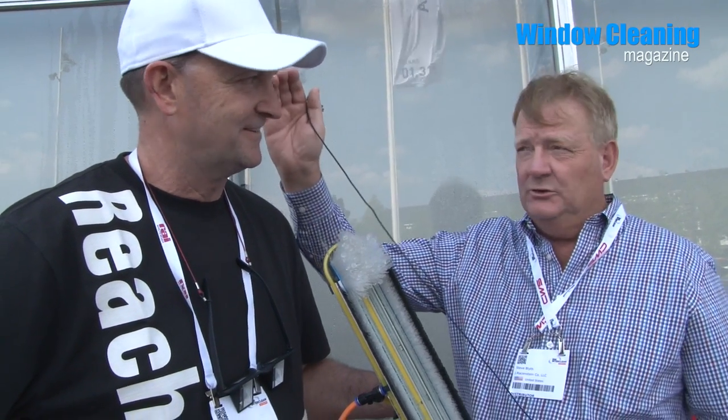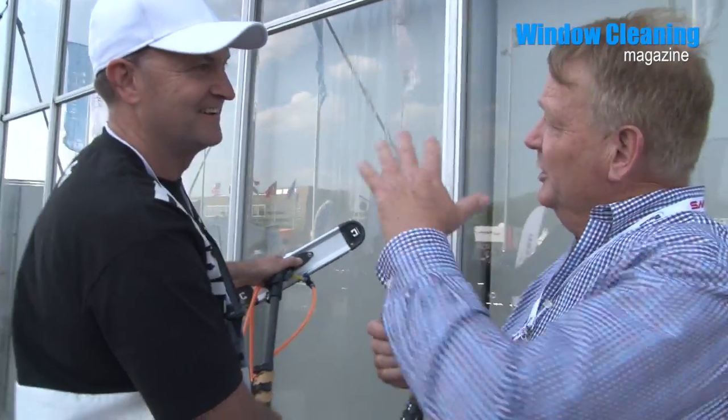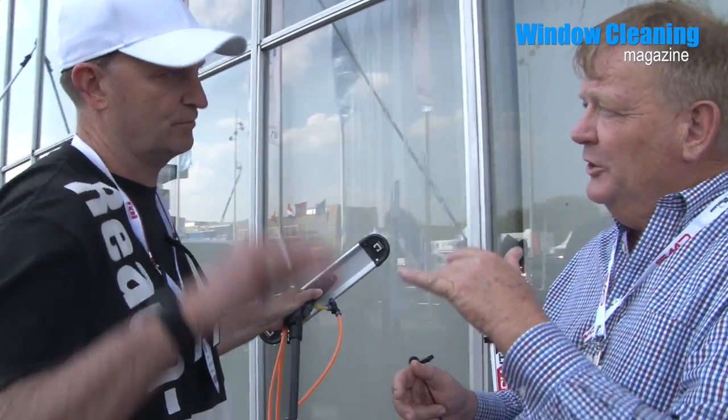One of the things done for big plate glass areas and large areas of surface like solar panel cleaning is the brush scaled out to one meter — the Excalibur, as it's called. With a one-meter brush in an Excalibur, when you're working with a large uncut piece of glass, large panels, solar panels, each stroke is the equivalent of multiple strokes of a smaller brush head. You're able to move along faster, with the water creating that knife edge for your agitation and rinse pull — several times faster than an average water-fed brush.